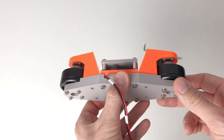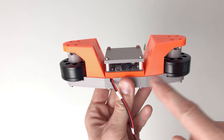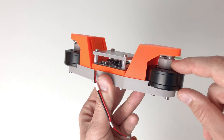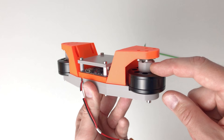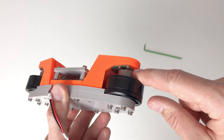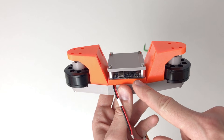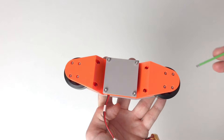For today's video I prepared this test piece. It basically consists of a controller and two brushless motors. Each motor has a 3D printed pad with a magnet on top, and in front of each magnet there is a magnetic encoder. The controller is quite simple and based on Arduino. Let me show you how it looks.